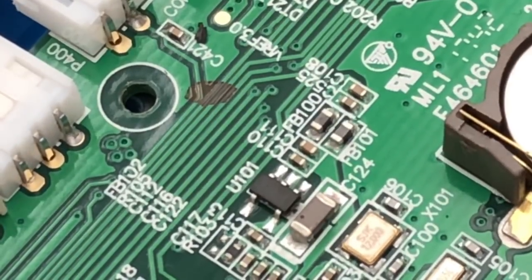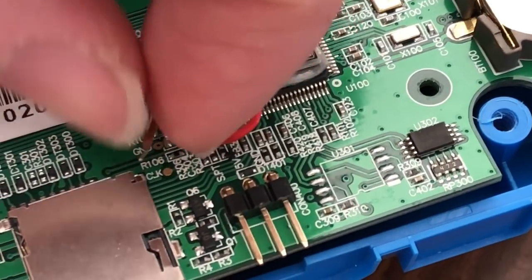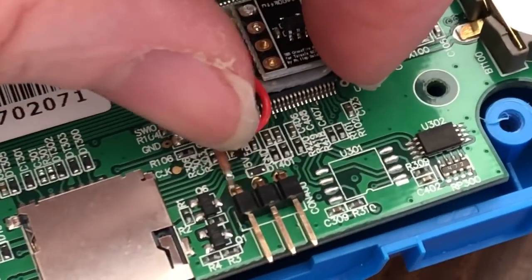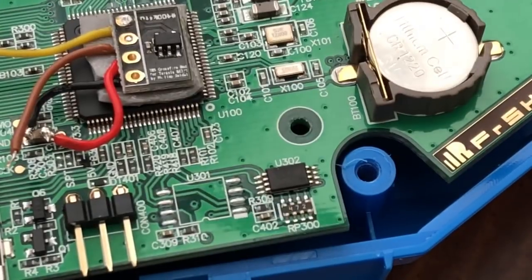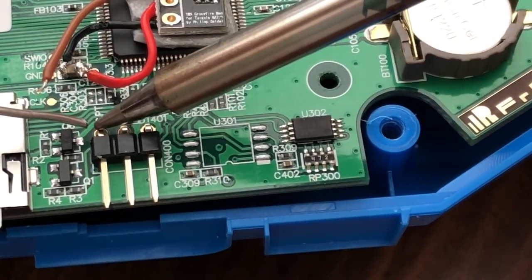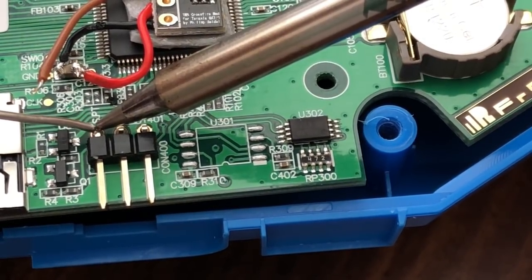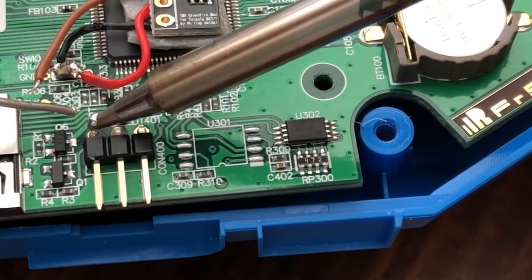Next spot to get is going to be the S port. Just going to be down here, like that. Well, I say like that, and your guys are nowhere near it. All right, so S port's gonna come all the way down into here, like that. And just get soldered straight on. So what I'll do is I'll add some solder to the port itself here, warm it up a little bit.